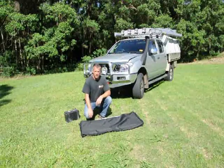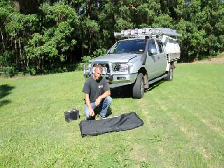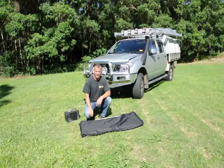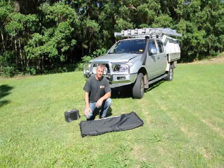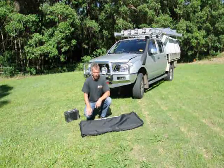This kit is a 160 watt dual panel — two 80 watt panels put together. They come with a 25 year warranty and provide 160 watts. The 160 watts will easily recharge a deep cycle heavy duty battery in half a day to a day, and keep your fridges running and all the accessories that are required.